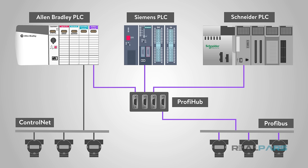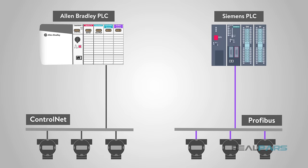This is not to say that every protocol is dedicated to a particular manufacturer and must connect to the proprietary controller. For instance, Profibus is a widely used protocol that can connect to Allen-Bradley, Siemens, Modicon, etc. The same applies to the universal protocol of Modbus. However, some protocols do not play well with others. ControlNet is an example that cannot integrate into a Siemens processor.